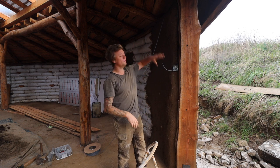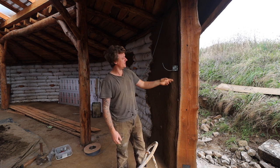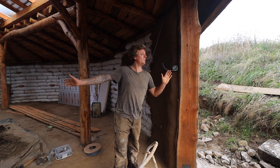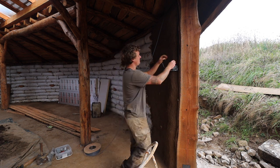And then I'm going to have a two-way switch, so a second switch but controlling the same lights, next to this door, so I can come through this door and also turn those lights on. So the switch on the stairs and this switch will both operate the main bulk of the lights, and then I'm going to have some individually switched lights over certain areas as well.